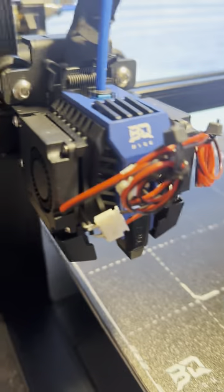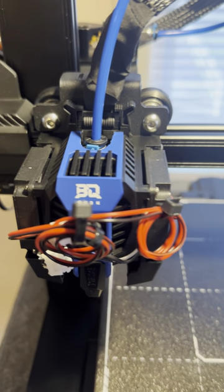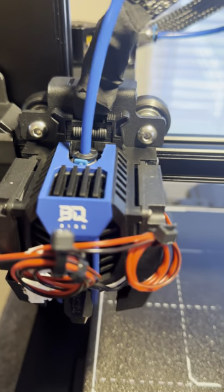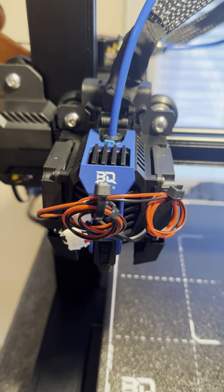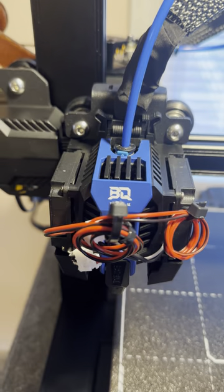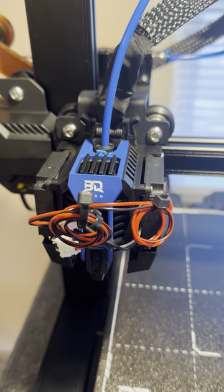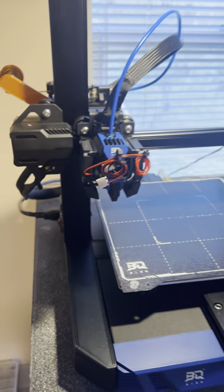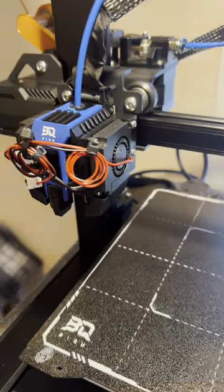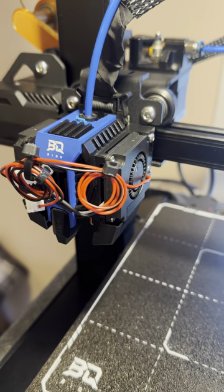There's the blowers. I found a really cool winged fan that I put on it. But getting it tweaked, getting it modified, getting it to work right was a real problem. The print on Thingiverse is too small — it didn't fit the blower fan, so I had to expand it to 106%, then 105%, then 107% to get the wings to connect up correctly. Long story short, I've had so many problems in the last month and a half. I decided to go back to the original configuration, but these fans have full-size two-pin connectors and they don't work with the board.